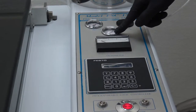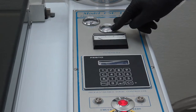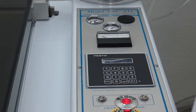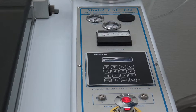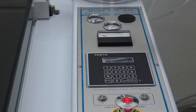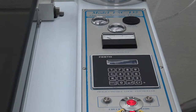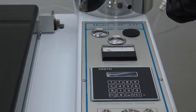The CO2 re-ionizer is set at about 20 psi. It is important to maintain that pressure set point as it is proper for maintaining the ability to mix the DI water and the CO2 — so that you don't have too little CO2, which will allow the corona effect to occur, or too much CO2, which will cause air to enter the high pressure pump and cause a gasket to fail.